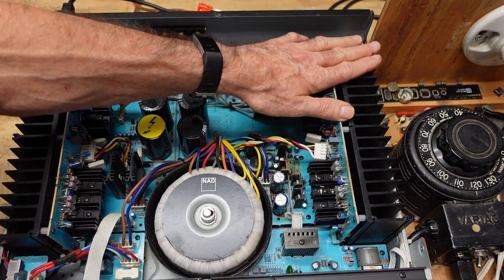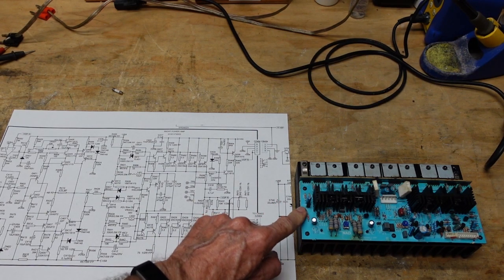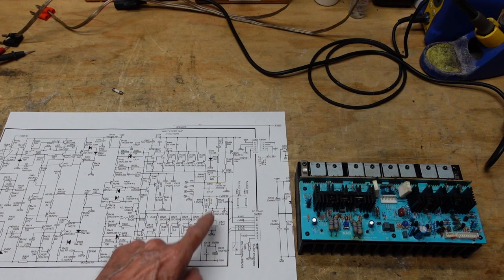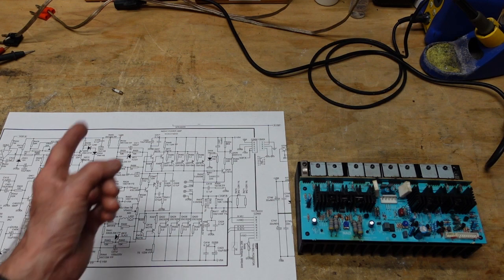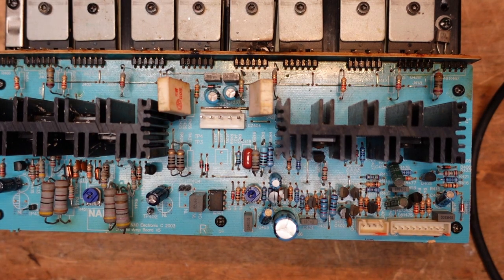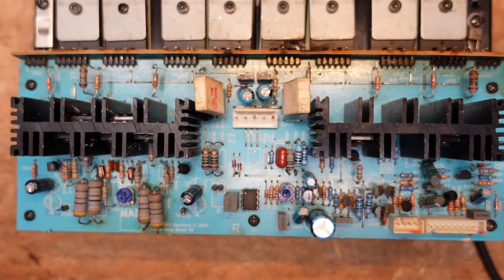We're going to pull this out and start taking a look at it. About half a dozen screws on the bottom of this heat sink assembly and the entire assembly pulls out. The first thing I like to do is print out a large copy of the affected area — this is the entire output stage. As we find our shorted or damaged components, we're going to mark them so we can trace a path. You'll find this is very important to make sure you get everything that was causing problems, or you may blow up your replaced parts again. The second thing I like to do, after printing out the schematic, is give the affected area a good visual examination. This can yield a good starting point, and in a case like this where we're dealing with shorted outputs, I usually just start right at the output transistors.